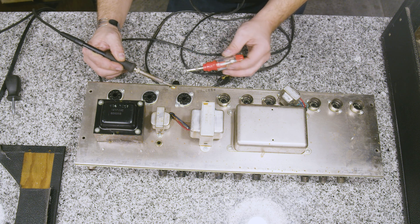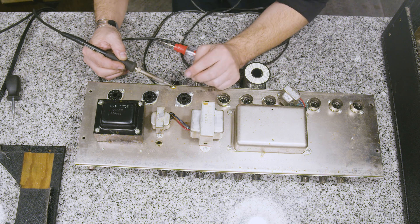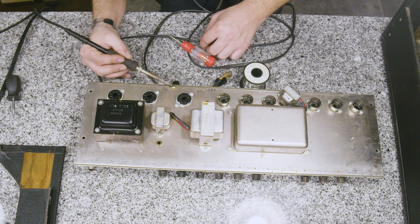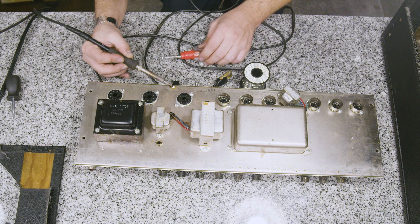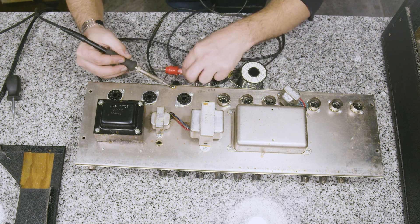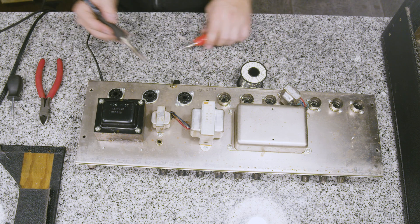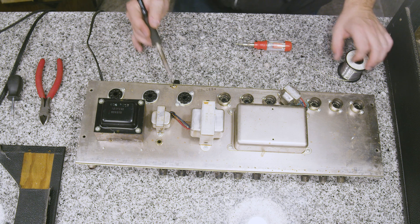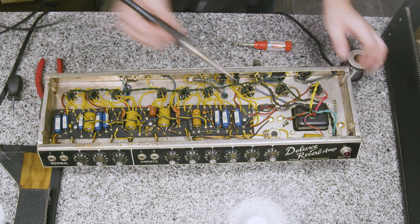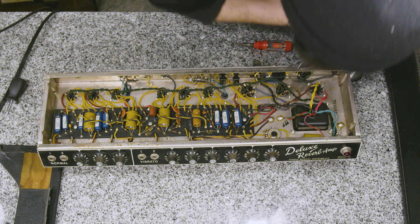I'm going to take our iron and just rest it on there and apply some heat. If you ever have old stubborn factory solder, it's helpful to add your own fresh solder to it, as molten solder creates more molten solder. I'm going to use a screwdriver once we get this molten to remove our death cap lead out of the way. Once you get that pried up from the chassis, you can flip it back over and come back to the inside and desolder it from the switch. Honestly, the easiest way to go about this is to just snip it out.